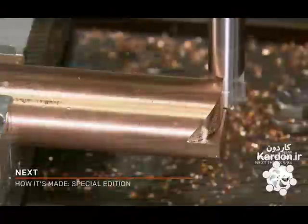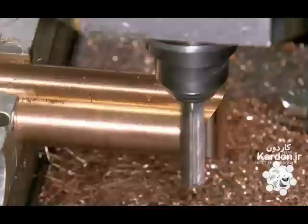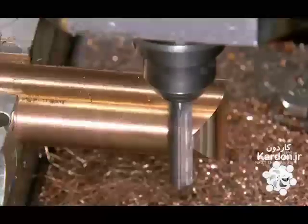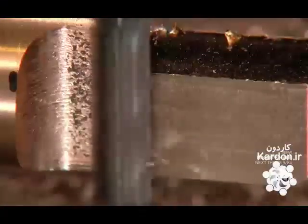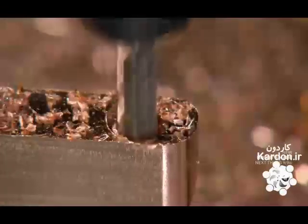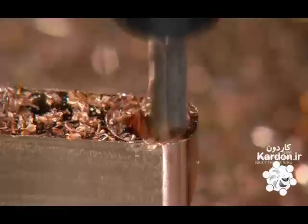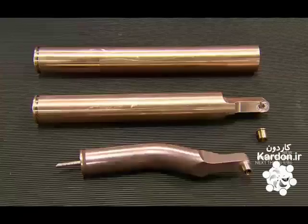Smaller electrodes are made of partially hollowed blanks. They shave down the blanks so that they will be able to weld in small areas. They also shape it so that the electrode cap will fit on top. They use another drill to make an entrance for cooling water. The entrance intersects with the hollowed part of the cylinder. Then another machine bends the electrode into its final shape.